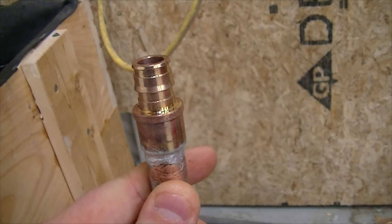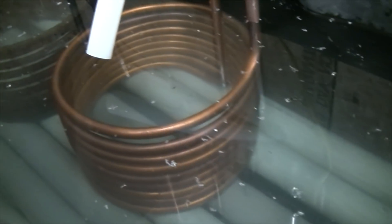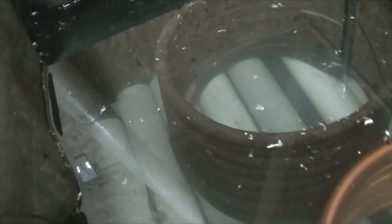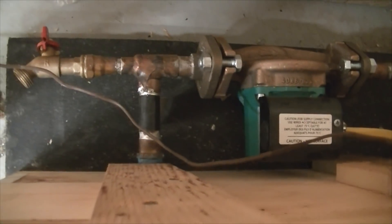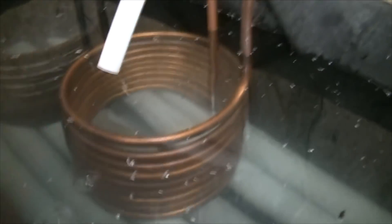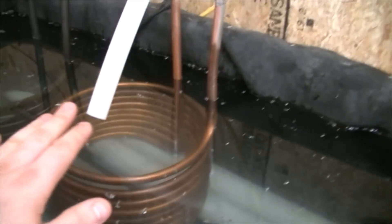I put on expansion PEX fittings and soldered those on. In the bottom, I tossed in a bunch of 2-inch PVC coming off long conduit. I did that for two reasons: first, to raise the heat exchangers up higher since hotter water would be towards the top; and second, down there is where the water comes out from the bulkhead fitting, and the PVC might slow down the turbulence when water from the solar panels splashes in, so the coldest water goes to the solar panels and the hot water stays where the heat exchangers are. I cleaned up those ends and got them all situated.